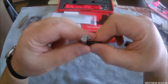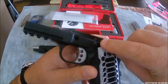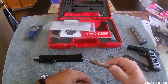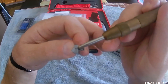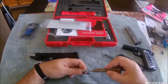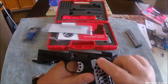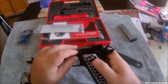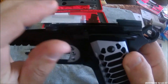I polished the backside of the slide stop, and then where the little detent interacts with the slide stop, I took a powered spring punch and punched right exactly where that goes. This puts a little detent - it's for drilling, but it put just enough of a detent. I finished polishing the piece to get it really nice and smooth like glass, so the little detent in the gun actually just barely locks into that.